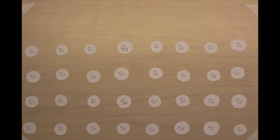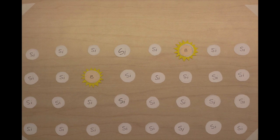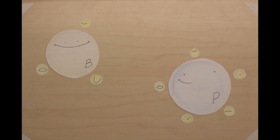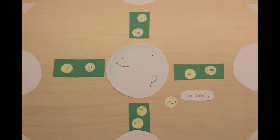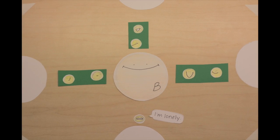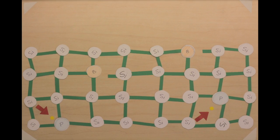But how do we do that? You add impurities to the silicon. On one side you add an element like boron, and on the other you add phosphorus. Because boron has three outer electrons and phosphorus has five, when they form bonds with silicon, on the phosphorus side there are extra electrons, and on the boron side there aren't enough electrons for all the bonds. What this means is that on one side you're lacking electrons, and on the other side you have extra ones.